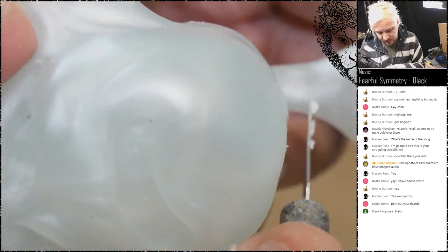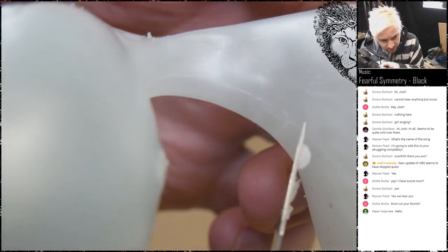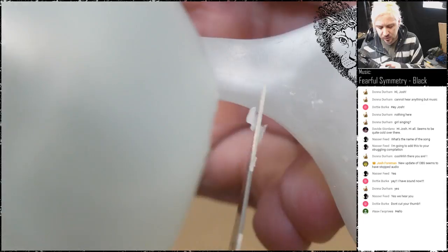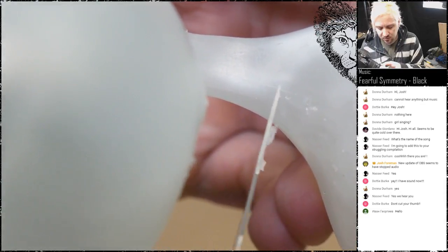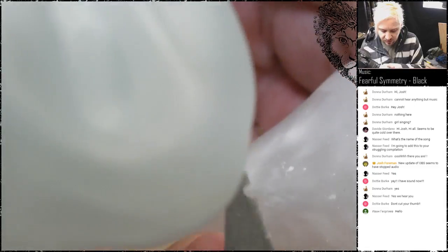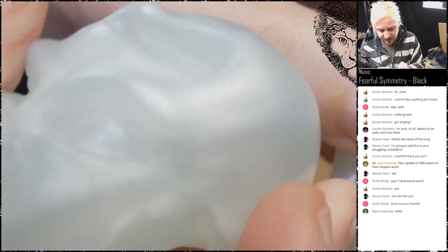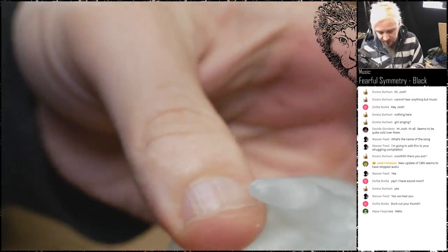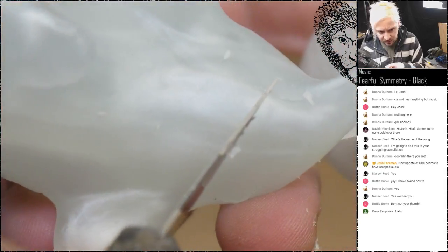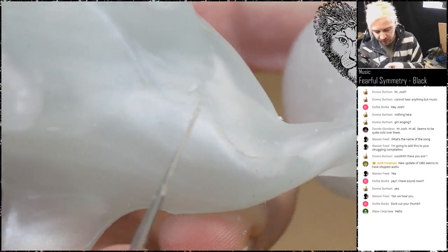Cleaning these little seams is a bit trickier. See, they're really subtle. Gosh, I love that we can see that much detail on my camera. Scraping is probably the best bet. See, sandpaper, if I sand it, then I have to go through this process of going up, I guess technically, the grit number progressively, and just becomes a real pain. Takes way longer than if you can just kind of scrape them off. But scraping works best on really convex surfaces, not so much on concave ones, since I have this flat blade.